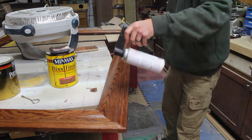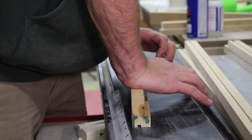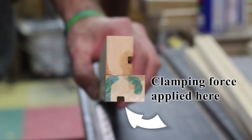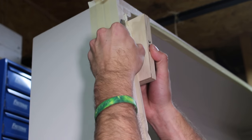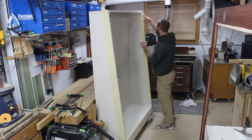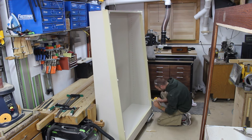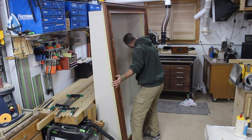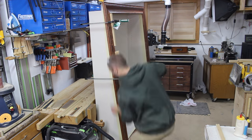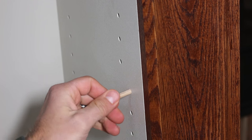In order to apply clamping force in the correct spot on the frame I needed to make special clamping cauls. They consist of two MDF parts with a saw kerf running down the middle. I glue them in an L to resist bowing and apply clamping force over a larger area. The saw kerf slides over the edge where the cove begins. I apply masking tape to the carcass to aid in cleaning up any glue squeeze out. The glue up was a bit stressful but I applied a generous amount of glue to the loose tenons and the MDF carcass itself, slid the frame in place and applied clamping force with the special cauls. I needed clamps with a throat capacity approaching six inches. I use simple quarter-inch dowels for the pegs as they will be hidden.